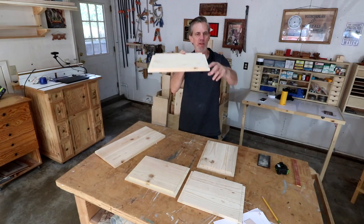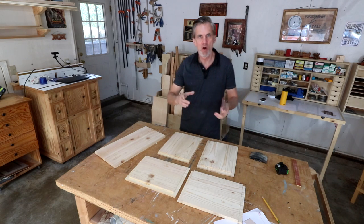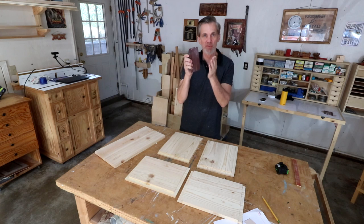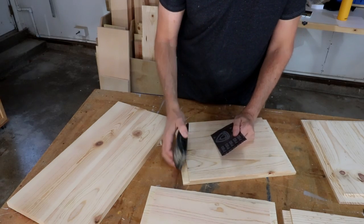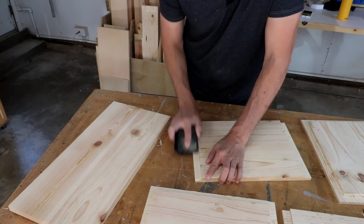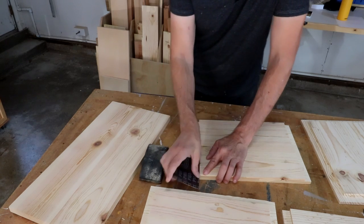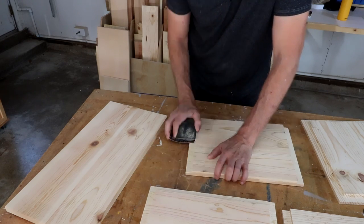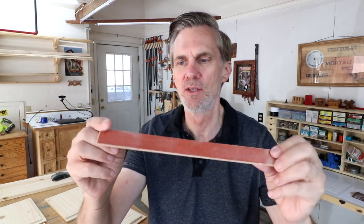The rabbets will likely not be perfectly flat and will require some sanding. Do this by hand using a small square block of wood with sandpaper held against it — you need a firm, flat surface for sanding. You can also use a store-bought sanding block. One of my favorite tools for sanding rabbets and dados is a sanding stick made from a paint stirrer with sandpaper glued on using spray adhesive.